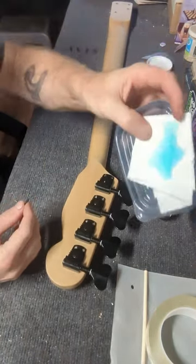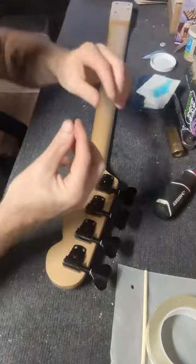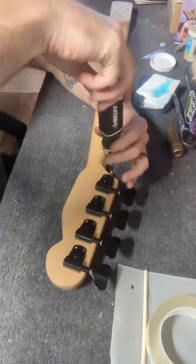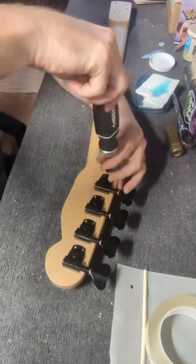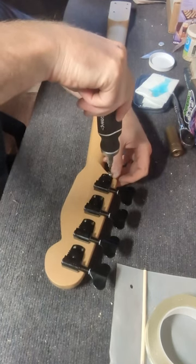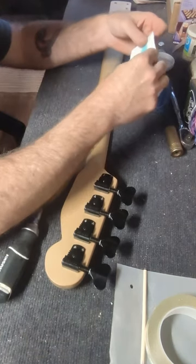This is some liquid dish soap. Take your screws and coat them with a little bit of soap — that will lubricate the threads. Then when you thread it into a pre-drilled hole with lubricated threads, screw it in until it's snug. You're not trying to kill it, and then you don't run the risk of snapping the head off.